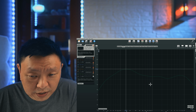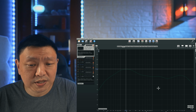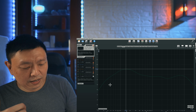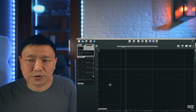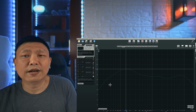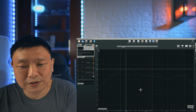And the volume here is peaking out at about 148 Hertz on the low end. So this is your bass frequencies hitting up to 100 dB. Now the mic is placed about 8 inches away from the speaker, so it is pretty close. It's not really the distance that you will be listening to things at, but I try to standardize so that it's easier and we cut away all the room reflections by close miking for this particular test.